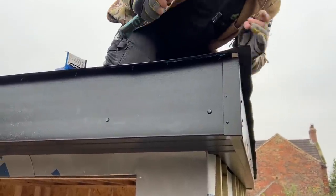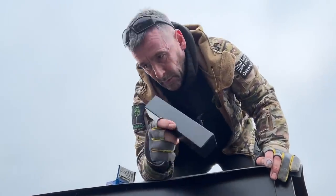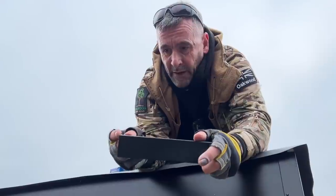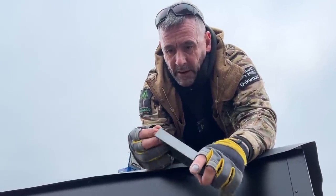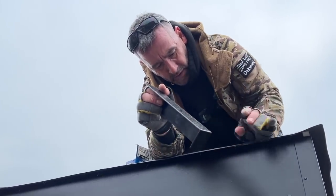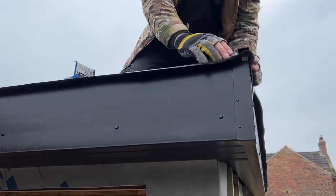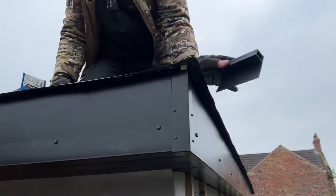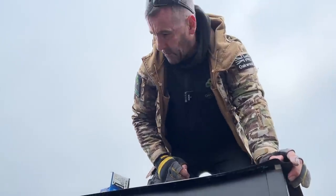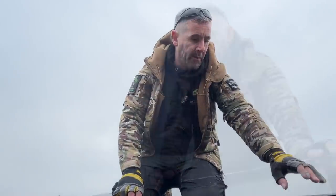That's on there. I'm going to go around and do the others. It's again as little power tools as possible — we've cut these with a big grinder, but you can cut them with a fine hand saw or a mitre saw — but obviously we're not using a mitre saw. They might want to shatter in the cold on the mitre saw, so just take a lot of time and a lot of care with them. The P trim will sit over there going that way, and P trim will sit there going that way, and then there's a little corner detail that goes over there. I'll explain that as we go along.